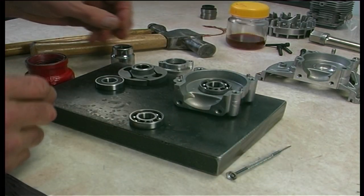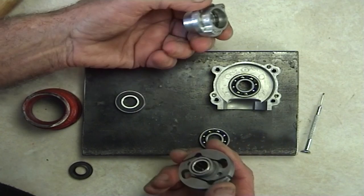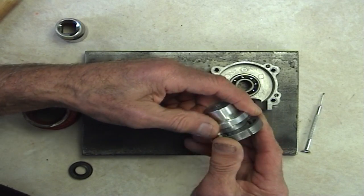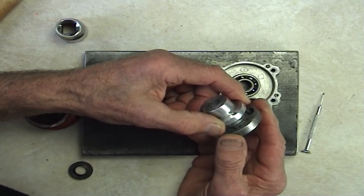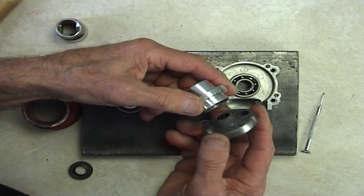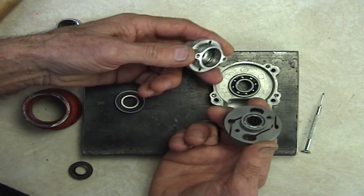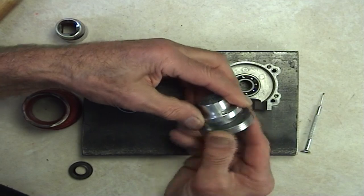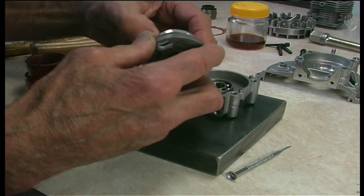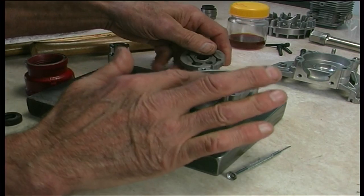As opposed to a tolerance fit: one item is marginally just fractionally smaller in diameter. This is your clutch adapter — you put those in together like that, there's no movement as such in there but you can still turn them. That is referred to as a tolerance fit: one item will be slightly smaller or slightly larger, but you can put them together and you can't actually feel any clearance. So we have tolerance fit and interference fit.